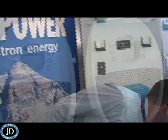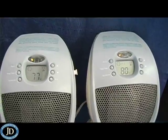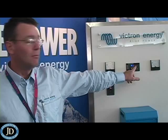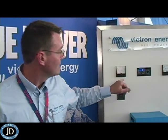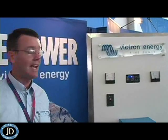Right now we've got no power coming in, the batteries are topped off. If we throw some loads on, we'll see the AC amperage starting to increase. We've selected this to only allow around 13 amps of power to go through. And here we've now gone into invert mode — we've got 13 amps of power going in and roughly 20 amps of power going out to our loads.